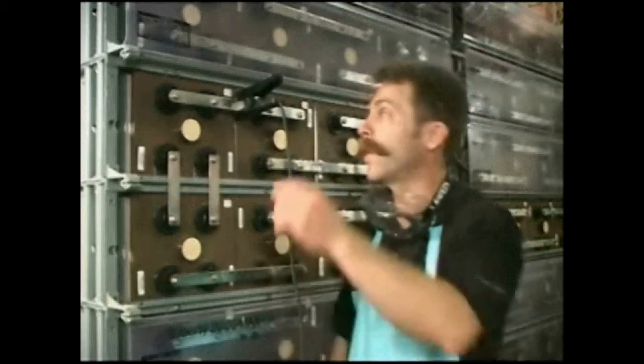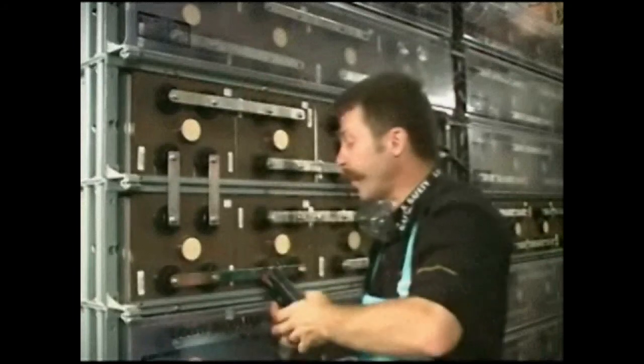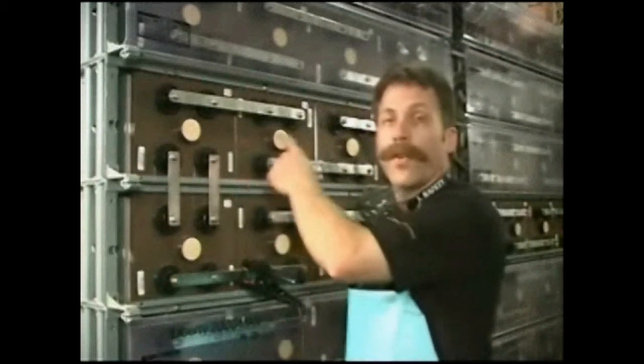To measure the second half of the string, you have to turn off the current switch at the transmitter and move the black current source lead down between cells 11 and 12, and the red current source lead to the negative bus. Then continue measuring starting at cell 13 through 24 in the same test. There's no concern with polarity since the red is on a negative and the black is on a positive, because it's an AC test signal on a DC battery — so there's no problem whatsoever with that.